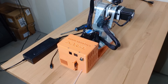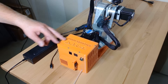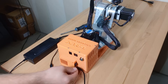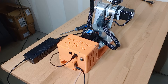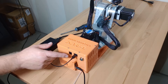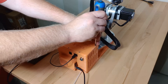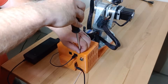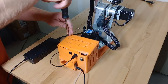As far as the changes on the Mark II, we've got a whole new 3D printed base enclosure. This uses a 24 volt power brick instead of the old power supply, which plugs into this fan enclosure. You can turn it on and plug a USB-C cable directly into the base of the robot. There's also a 4-pin connector for gripper control and an RJ45 for the 7th, 8th, and 9th axes. This design makes the robot a lot more compact, putting all the drives into the base so we don't need a large external enclosure anymore.